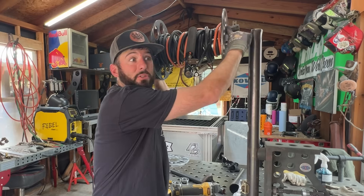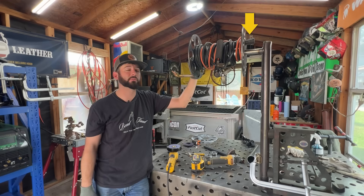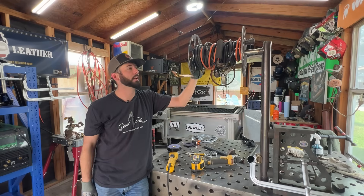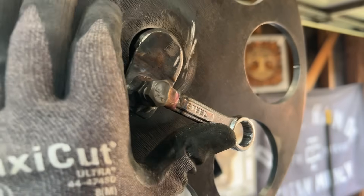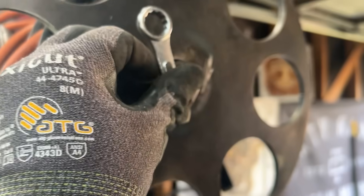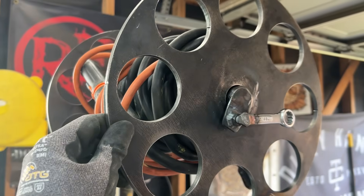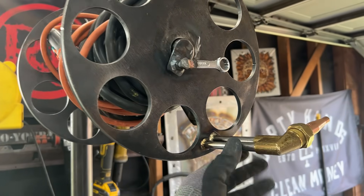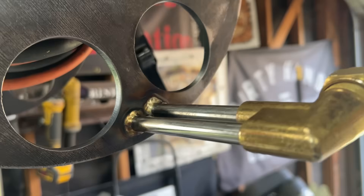I wanted to keep it simple — just put a hole in the side so we could stick our Dinse connector or LC-40 right through it, just a hole big enough that it kind of gets wedged in there. On the other side, we've got this little brake system and it'll help this thing roll really easily. If I want it to stop, I can tighten it and it won't move, or I can give it a little tension so it won't free spool too bad on me. It's a really simple setup.